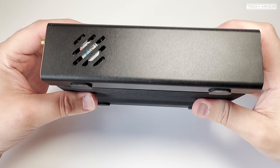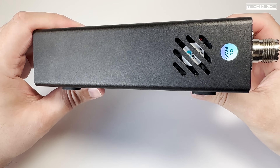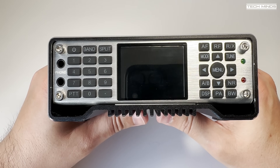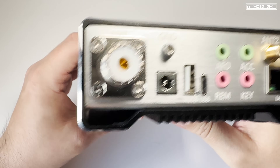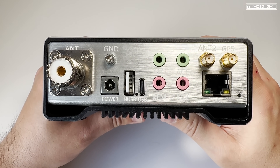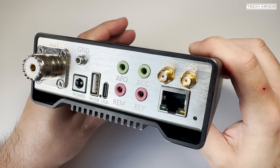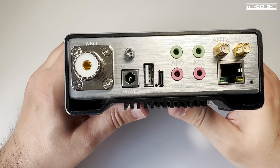The other major update is the RF routing when using VHF or UHF. This has been changed in V4 with all RX and TX for VHF and UHF coming in and out of antenna port 2, which is the SMA connector. Then HF, 50, and 70 megahertz all comes in and out of antenna port 1, which is the SO239 connection — much more like we're used to seeing on top tier radios.